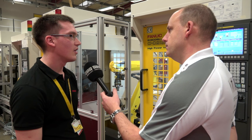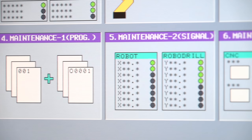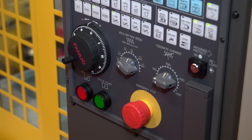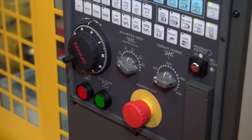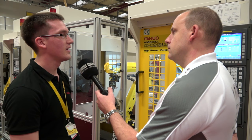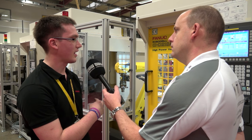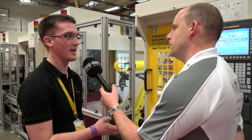After that, on the CNC side there is a page in the manual which lists some settings that need to be changed — keep relays within the CNC that just tell it that the robot is attached, that it's a left or right-handed door, because obviously you can have a door on the left or on the right. It goes through all the safety settings as well, activating the DCS settings between the two, which allows e-stop and fence circuit to go between the two down the Ethernet cable.